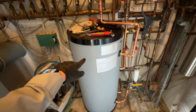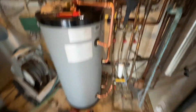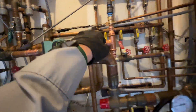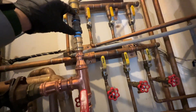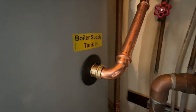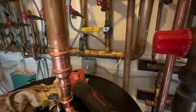First off, here's the tank. I haven't pressed anything in yet. This is our heating supply line with an air vent. This looks kind of dumb, but that's what I had to do. We can always swap out this for one fitting later, but the supply line comes down with 45s right into the boiler supply tank in. Here's our return out, which goes up and onto their manifold.